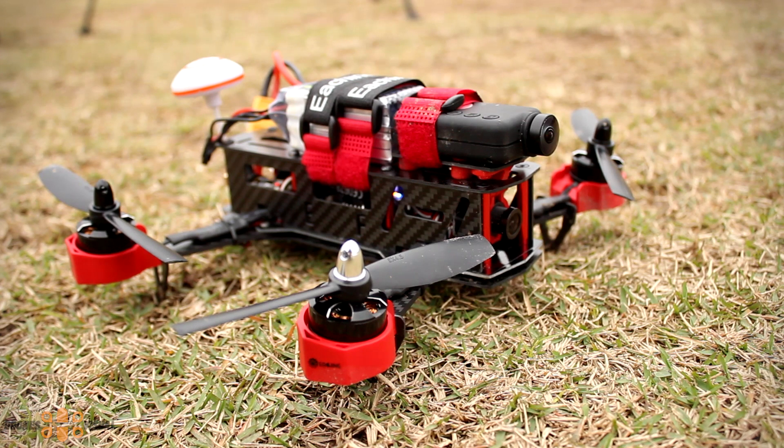What I didn't like much about this FPV Racer: it can be quite hard to access some components like the USB connector on the flight controller and the connectors on the receiver. It also comes with a 3S battery rather than a 4S — I think it should come with a 4S since it performs much better with one. Also, the video transmitter was downgraded from 600mW to 200mW and the OSD unit was removed compared to the Eachine Razor 250. Other than that, I think it's a great choice for anyone with little or more experience — you get real power out of the box, and if you can do some tweaking you can connect it to your computer and input your own settings.